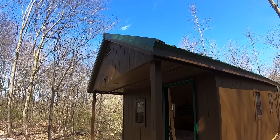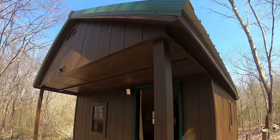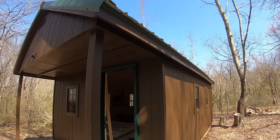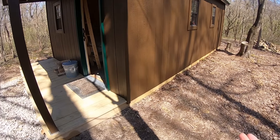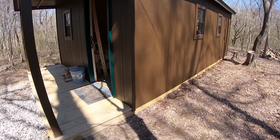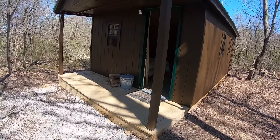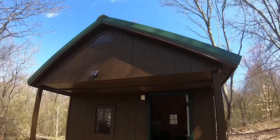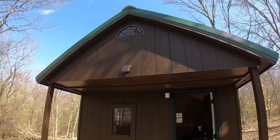The overhangs on the outside were more for looks than anything, though they do help keep water off the sides of the building. I hadn't planned on putting gutters on but I may end up doing that, because when it rains hard the water runs down and hits the dirt, splashing dirt up on the side of the cabin and water on the wood — and that's not good for any building. It might be a good idea to put gutters on it, and if I do I'll be installing some sort of rain catchment system so we can use that water for things at the cabin.